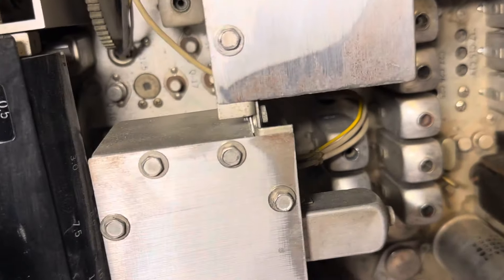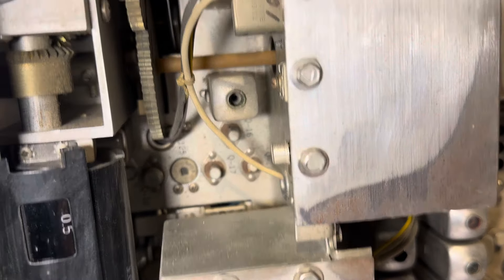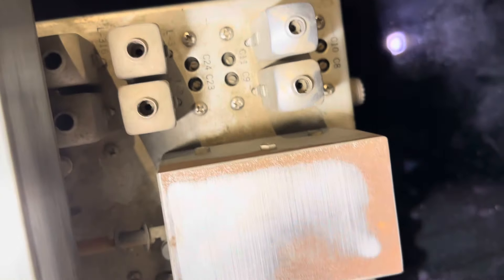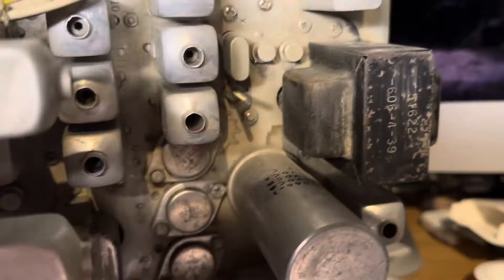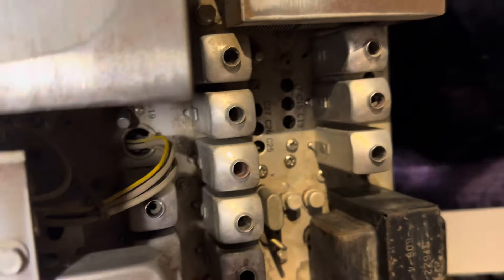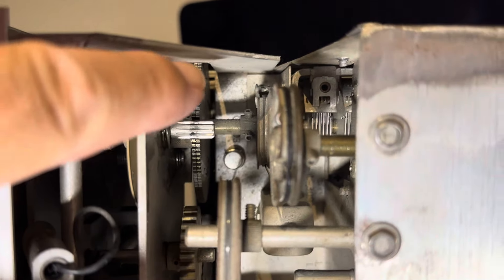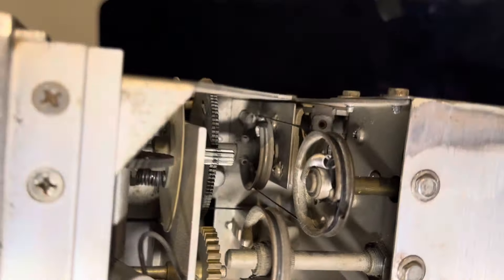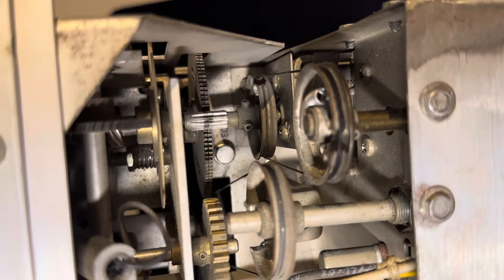I took acid to this lid a bit and it did clean up somewhat, so I gotta get these lids cleaned up. I debated soaking this thing in water and hosing it off — I don't think I'm going to go there. I'll probably have to Q-tip clean this thing carefully. I started pulling out these transistors — they're all socketed, so just pull them out and rub them back and forth to get the contacts cleaned. Some of these you can't get to very easily. I also oiled some of the bushings for the synthesizer — it still has a nasty squeak to it.